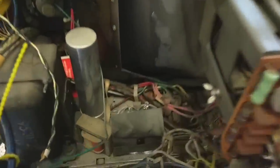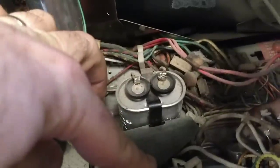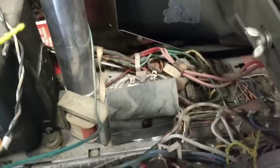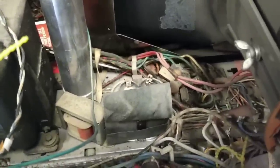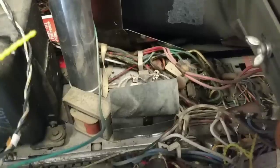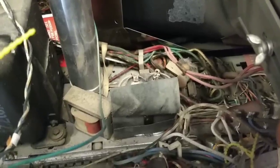The oil cap in question is this guy down here. It's a 3.5 microfarad at 450 volt. And the replacement is quite a bit smaller. It's more or less just a little motor phasing cap. Same value, 3.5 microfarad, 450 volts AC.